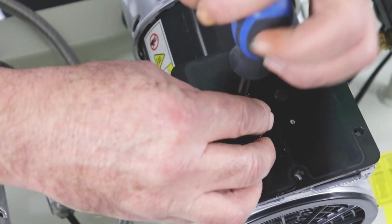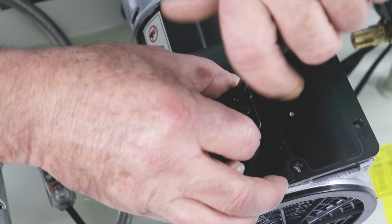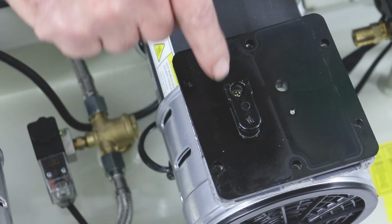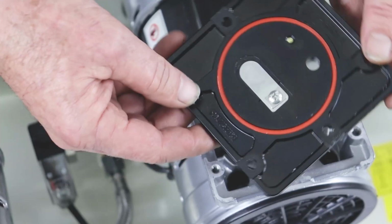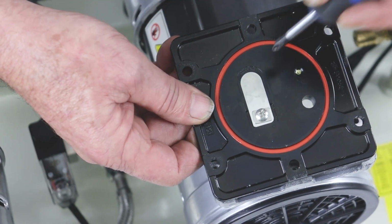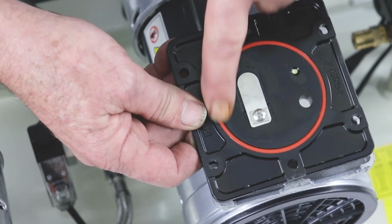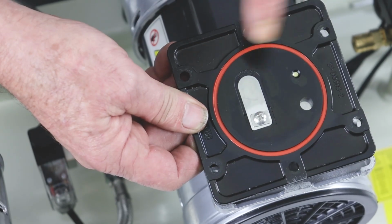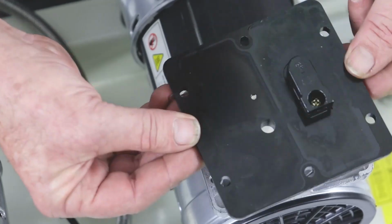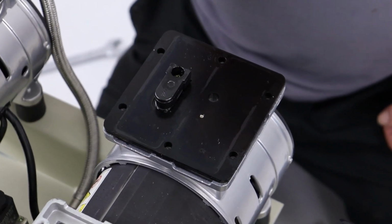Okay. So these little valves, as I say, are important, and over many, many hours of use, you may see cracks or distortion in the little valves. So that's the most difficult one to change. That's back in place. And as you can see, this one's fairly simple, but again, it will have that slight curve. Make sure that it's curved downwards. Following that, we have this O-ring here. If there's any damage or problems with this O-ring, all these bits and pieces are available from our parts department, including this complete plate. Okay, so we would inspect this side of the pump in exactly the same way.